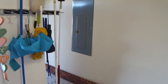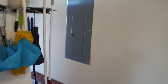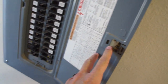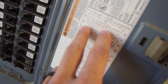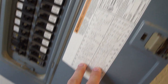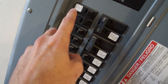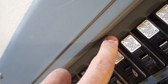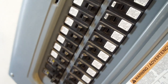In order to shut off your electric, you need to locate your breaker box. This breaker box for this particular dishwasher happens to be located in the garage. A lot of times they're either located in the garage, a basement, or in the kitchen if it's a smaller condo or apartment. Typically when you open up a breaker panel, you'll see that an electrician has labeled what all these are. It shows on here that the dishwasher and disposal is labeled as number 19. So if you go over to these breakers and find number 19, you can shut that breaker off, and that's turned it off to the garbage disposal and dishwasher.